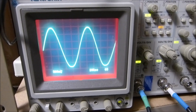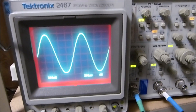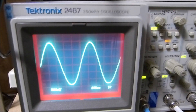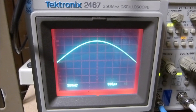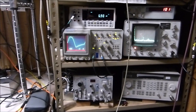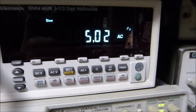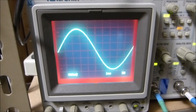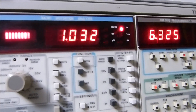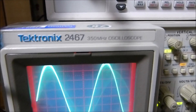The upper end is phenomenally good — really quite amazing how well it performs at the high end. The low end is not bad at all. Let's go to 100 Hz — I'll turn the feedback out and keep it at 5 watts. At 100 Hz, THD is 1%.